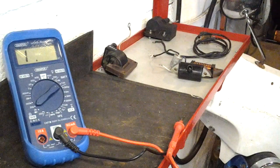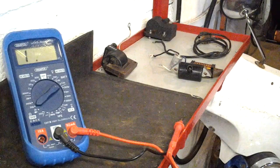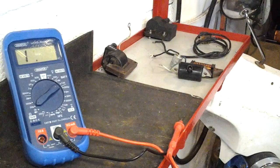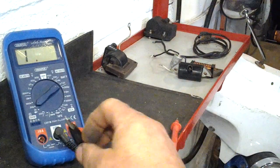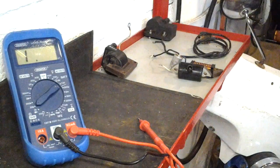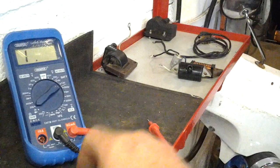I hope that was helpful. As long as you've got a multimeter — a digital auto-ranging one is probably better if your eyesight isn't brilliant — it's very handy to have crocodile clips as well, because you're not having to juggle two probes at once. You can just connect the clip to your suitable ground and poke away with the red probe.